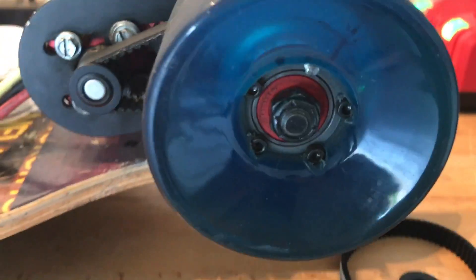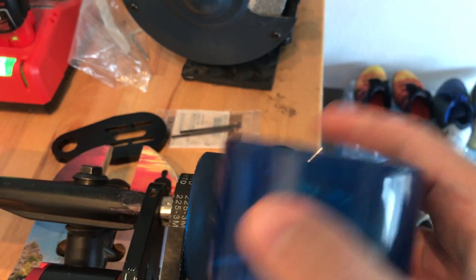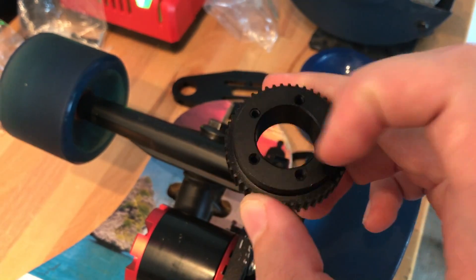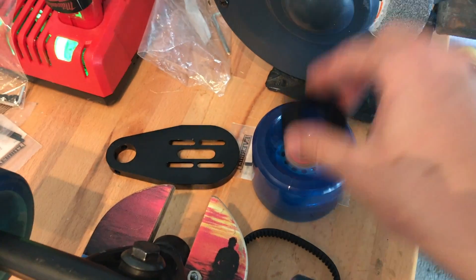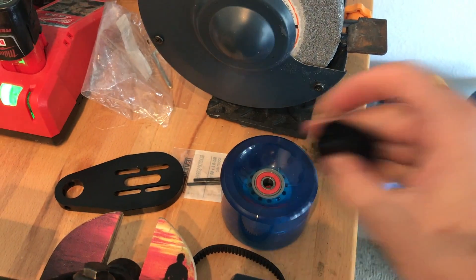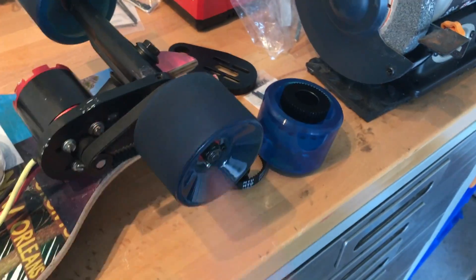Moving on to the gear and wheel system — on your longboard wheel there's a flat part and an angled part; the flat part faces into the wheel. Once you do that, you're going to get your big gear, which looks like this from the kit. There are five holes and they're all threaded. Put a washer down and place the gear on top. Then drill five holes through the washer and through the entirety of the wheel. Put everything down like this and get your long M3 screws, then run them through the entirety of the wheel, through the washer, and through the gear. That's held up great — it may deviate a little, but the board seemed to balance and correct itself through the human error of lining up all the holes.